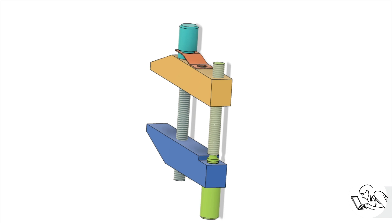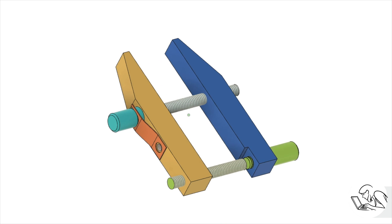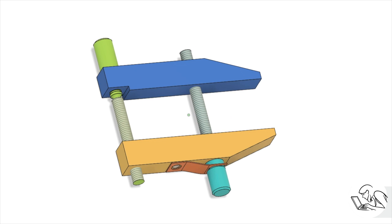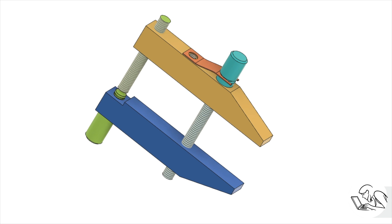There's another common design where the two thumb screws are both threaded through — basically a double clamping action. There's a clearance relief on the back screw for some sort of clip or nut to hold the screw in place, and both designs utilize a spring clip at the top. A reasonable question is: why aren't the clamps simply symmetrical? My best guess is to maximize the clamping surface at the front of the jaws, and on the rear knob you don't need that area for clamping — it's just simpler construction.